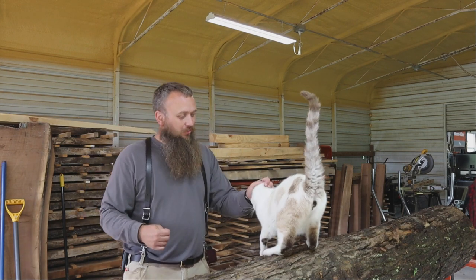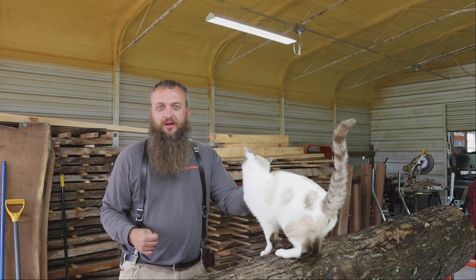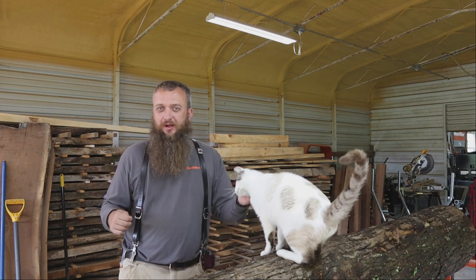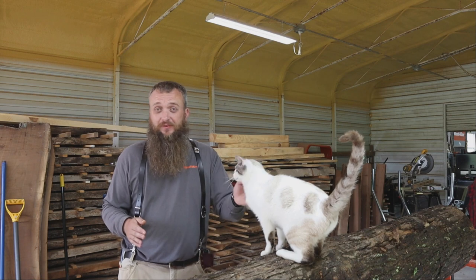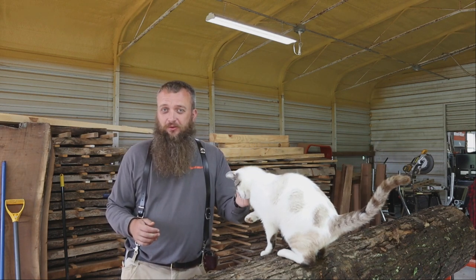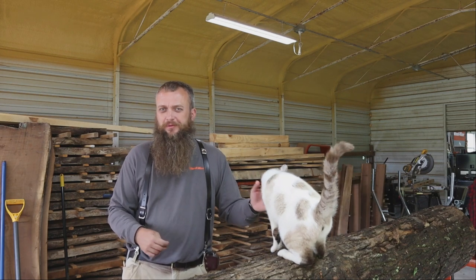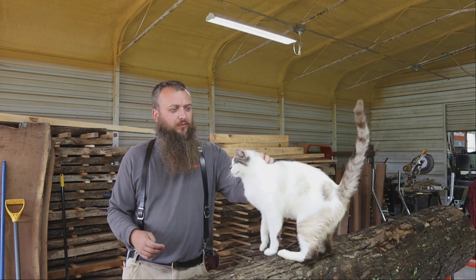But anyways, we'll see how this goes. We're gonna flat saw about 4 boards around this after we square it up. And this is some hard wood, guys. That's why we have that 4-degree blade on there, because hickory is just so abrasive. It's stout stuff, and my sawmill should be okay with handling it, but we may go through some blade changes if we throw more hickories on here today. I don't know. We'll probably just do this one, and I'll sit back and see what the yield is and find out what I want to do with the rest of them.